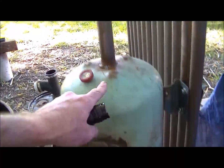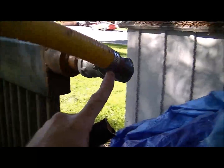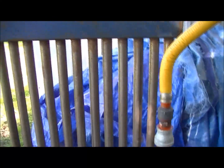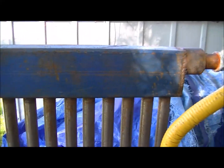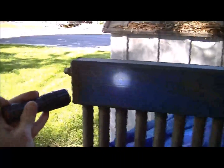Here's the cyclone that I built out of a freon tank and it drops down into a propane tank. I put a valve here and one here to drain, so I can shut this valve and drain without shutting the system down if I need to while it's running. The gas comes out the top — this tube goes all the way down to about two inches from the bottom, then up through a stainless steel tube I got at a recycling place into this radiator I built. It's about four feet high and about 30 inches wide. The gas comes in through the top, and I've got a tube inside that goes clear to the end with holes drilled in it. It will spread the gas throughout the radiator, and this plug here is to run a brush through to clean out those holes if needed.